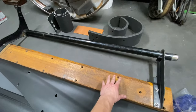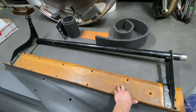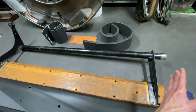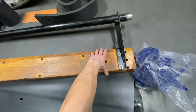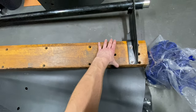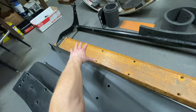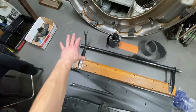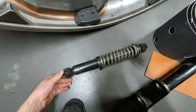Both of these items differ depending on whether you're putting it on an even lane or an odd lane. On an even lane, the mount for the shock absorber will be on the right-hand side; on an odd lane it will be on the left. For the plank on an odd lane, the right side is the thinner side and the left side is the wider side — the wider side is always where the shock absorber mounts. You'll also need a good shock absorber with good bushings.